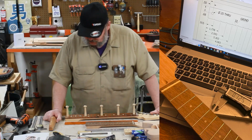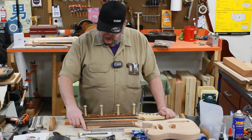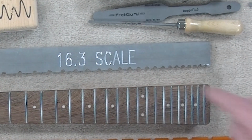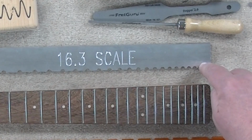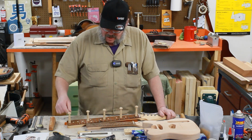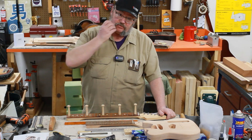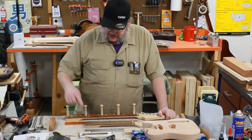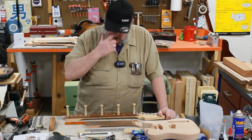And then I tried to program it in, and apparently my computer was not having a good day, because there is a spot right there. I don't know if you can see that. I'll probably have to take a picture of it. And for some reason, it would mill up here. It would come down, and then it would mill this one spot, and then it would go back this direction. Can't tell you why. It's not in the program. The number that it went to was not in the computer, and we don't know. We loaded it. We reloaded it. We restarted it. I mean, we turned it off, turned it on again, the stuff you're supposed to do. It's my nod to the IT guys. So what I ended up doing was I just programmed in the coordinates for each one of these, and then I just manually drove the mill in for each one of them.